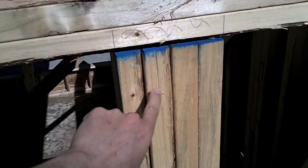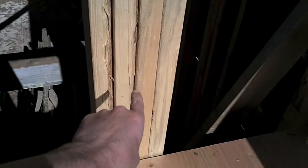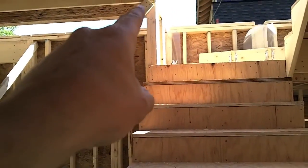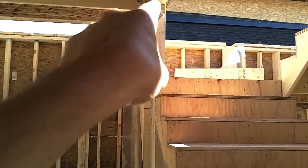What we've done is put 2x4s together, and those 2x4s go all the way down to the ground — they actually go through our floor right down there. The load goes through our floor; the 2x4s stop on the floor, but underneath comes our foundation. We've got those pony walls supported by more structural lumber down there, and that point runs all the way right down to the bottom of this foundation. That is the load, that's the point where it lands — that is a point load.